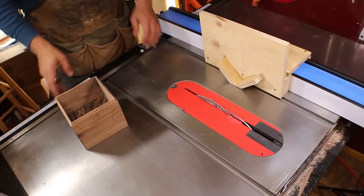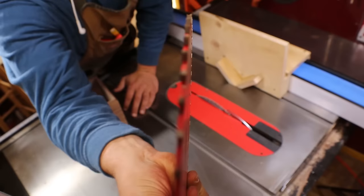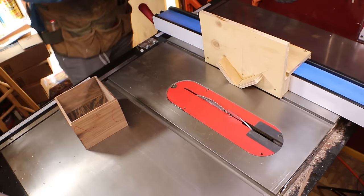One of the things that's really important is that you use a saw blade that has a flat tooth pattern. When you look at like these Diablos, they have very pointy teeth and they leave a groove that has a spike to it. So you want a flat bottom groove, otherwise you'll have that really annoying gap in your blade there.